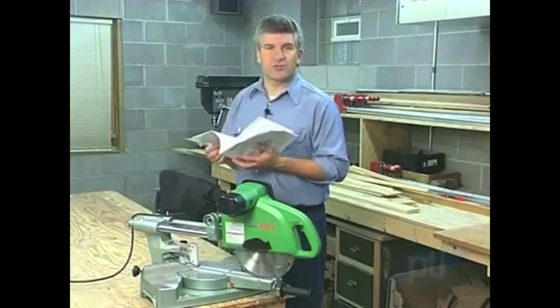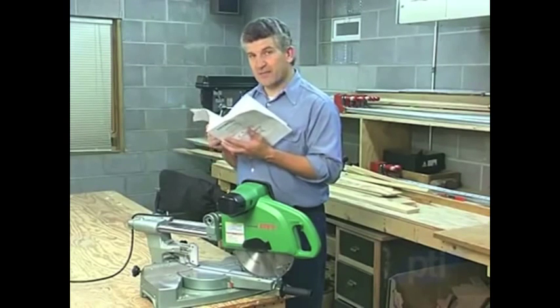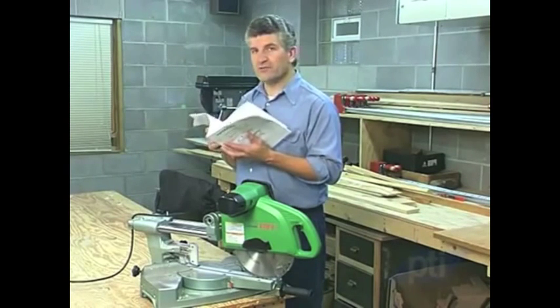Be sure your power tools are properly maintained by checking the manual to determine what user maintenance is required. Each manufacturer has their own set of recommendations for proper maintenance to tools. Some tools are permanently lubricated and require less maintenance than other tools, but it's always necessary to make sure that you maintain the proper operation of the guards. If light lubrication is necessary to make sure that the guarding is working swiftly and properly, that's your responsibility.